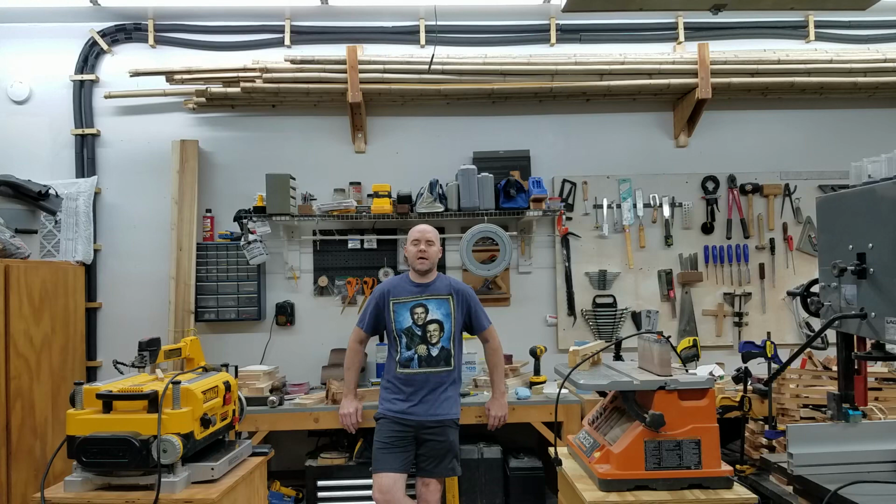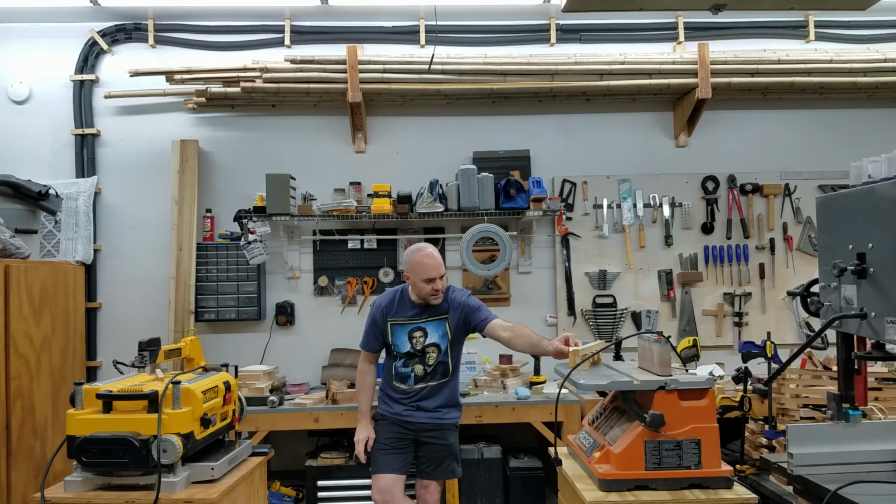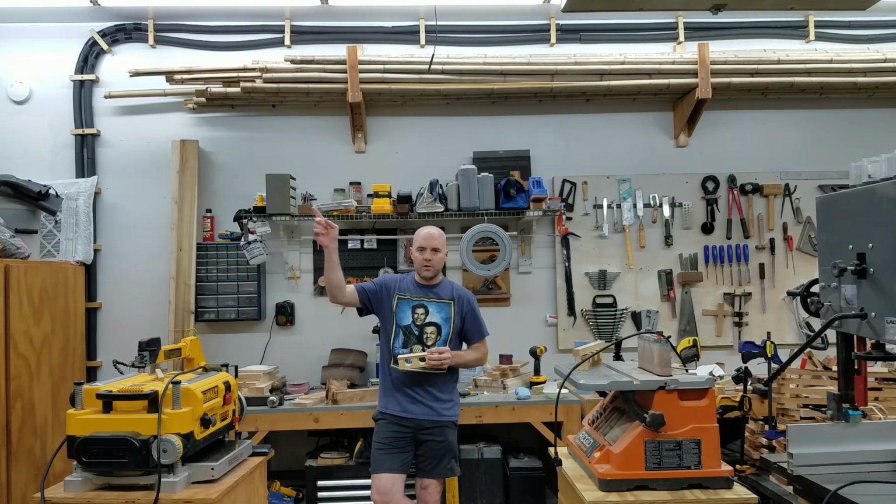Anyway, for this situation, I had a plumber come out, a couple plumbers in fact, give me estimates, and it was going to be around $1,500 to $2,000 to get all the plumbing replaced, and that actually wasn't going to turn out quite how I wanted it to. That was just going to be to put in the pipe, but not insulate it. And I really wanted to have the pipe insulated because that's going to reduce the risk of freezing and broken pipes later, and it also keeps your hot water hot in the winter and your cold water cold in the summer. So what I came up with was this handy little device, which I use to mount all of these pipes along the walls here.